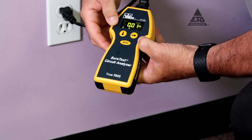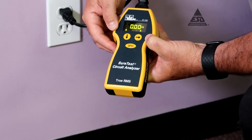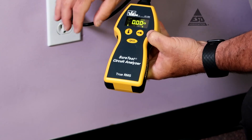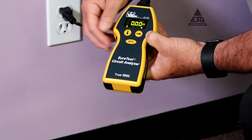We go to the impedance measurement for the ground, and you can see it's very low — in fact, the meter can't measure it, so it's much less than 1 ohm. At this point, we've established a good grounding system and a good grounding place to connect. We can start connecting our ESD control equipment to this particular ground. The other outlets may have to get fixed before we do that.